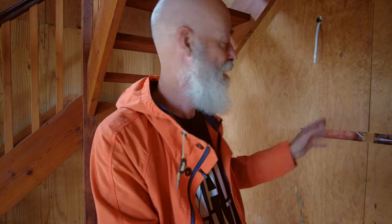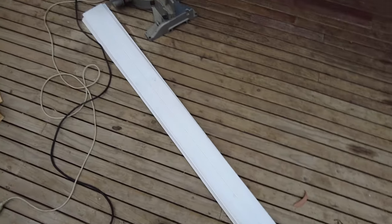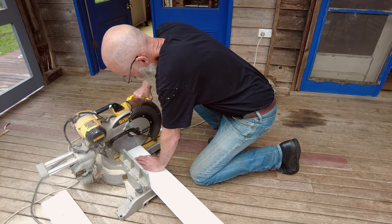The first thing we did last week was just to realign some of the power so that we get some places to put in lighting — wall lighting in this case — and we've also rearranged the power points so the GPOs are in a better spot to make use of the room a little bit better. Today we've made a start installing the pine lining boards. These are a Regency groove type of lining board and they will be going all over the ply walls.